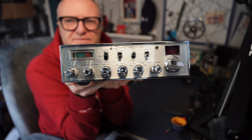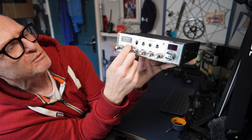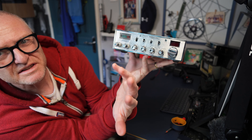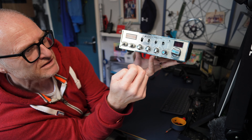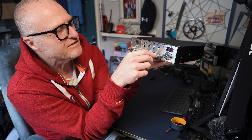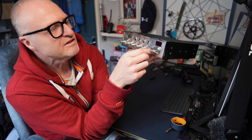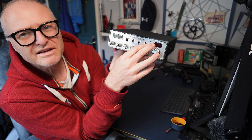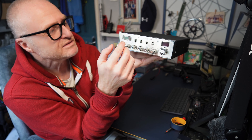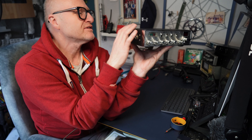Here's a look at the radio. If you're not familiar with these, they're pretty straightforward — you've got your volume, squelch, mic gain, RF gain, SWR calibrate. Obviously your band selection: this has got six bands in it now, which will be UK 40, low, and super low, super high, high band, mid band, and CW/FM, upper sideband, lower sideband. Pretty straightforward. Your fine-coarse clarifier, KC shift, channel 9 — that's still active, still works. Tone high and low still works, noise blanker and automatic noise limiter still works.